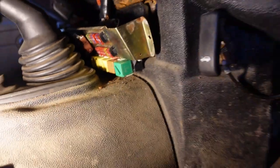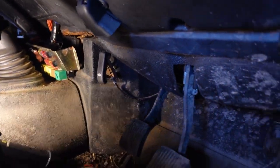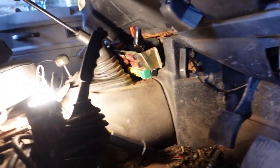Let's turn the ignition on and see. Yep - I don't know whether you can hear it, but the pump's running with the ignition switch. Simple as that. So I'm going to order a couple of relays and keep one in the vehicle as a spare.